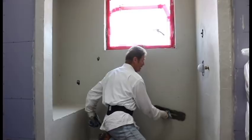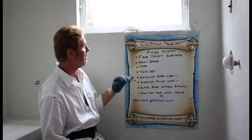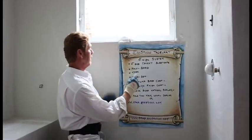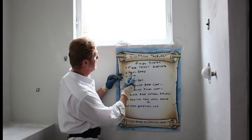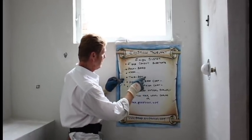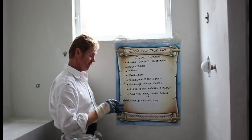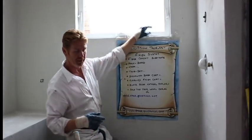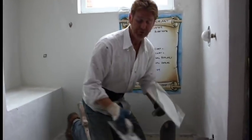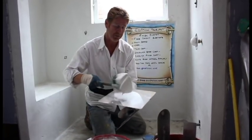All right guys, Kirk here. Let me tell you where we're at. The fellow already did all the Wonderboard and the waterproof membrane. We did the poly bond, the mesh, and the thinset. Today we're doing Deco Lime. Deco Lime actually spreads out kind of like taping mud — it's actually quite simple. It's only for professionals, but this is the easy product to apply.